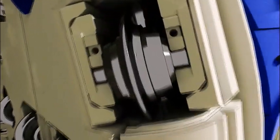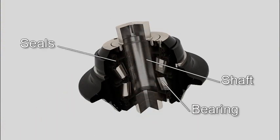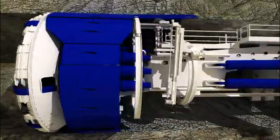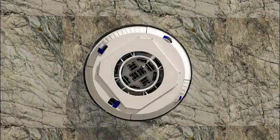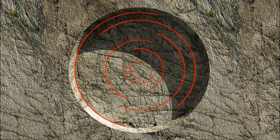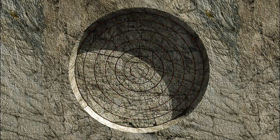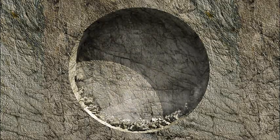The cutter head holds disc cutters, which consist of a shaft, bearings, seals, and a rolling hub. The disc cutters are not powered directly. As the cutter head turns, the disc cutters roll when they make contact with the rock face, rolling in concentric circles. As the force on the cutter head increases, the rock beneath each cutter is crushed and fractured. Eventually, these fractures meet and rock chips, or muck, break away from the tunnel face. This process is known as kerf cutting.